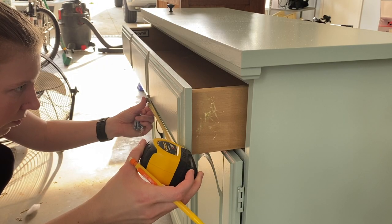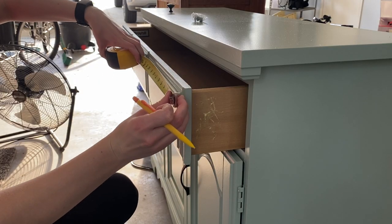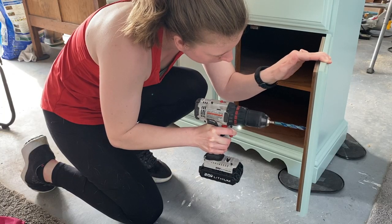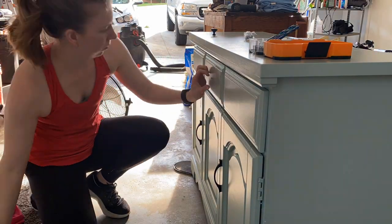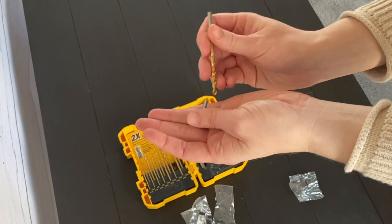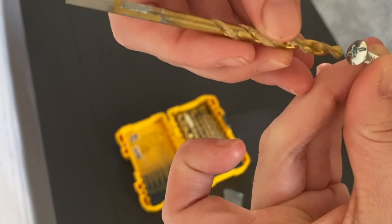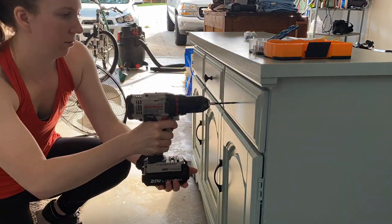There are a couple of ways you can measure out the hole pattern of the handle: you can just measure between the holes and then measure on your furniture piece, trace the pattern onto a popsicle stick and use that as a template, or just hold the handle up to the furniture piece and gauge the hole from there. Once you have your marks, you'll need to drill the holes. To choose a drill bit, I like to take the screw for the new handles and hold it up to the drill bit end to end — looking for a drill bit that is slightly larger than the screw but no larger than the head of the screw. Then put your drill bit in your drill and start drilling out your holes.